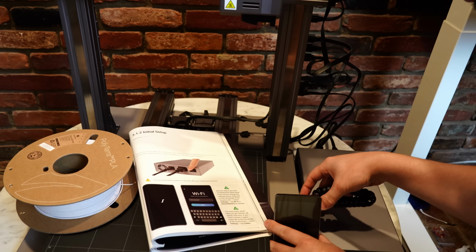See this filament? It came loose, and now as that feeds, it's going to get wrapped around stuff. Now you can see this belt. This is the longest it'll have to stretch at any point during a print. So you're going to want to make sure you've got enough slack to be able to reach all the way to this bottom left corner when it's down in the home position. But enough talking, let's get to printing. Looks like this first layer is going down pretty well.